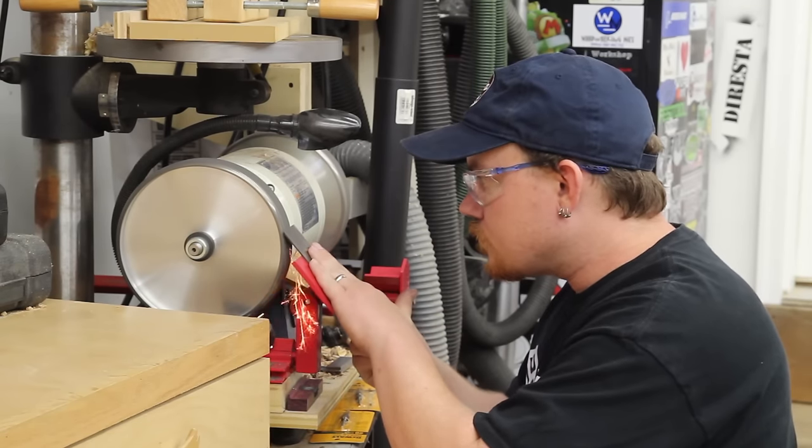With the backside of the blade up, making sure not to ding the front edge, the blade can be set into place. There is an adjustment lever back here that rides inside this slot of the blade, so making sure it is properly in place before the lever cap is installed. The lever cap holds everything together — this is pretty loose still. So with the lever down, you can tighten the screw. This needs to be tight enough so that you can still adjust this with one finger as you're working.